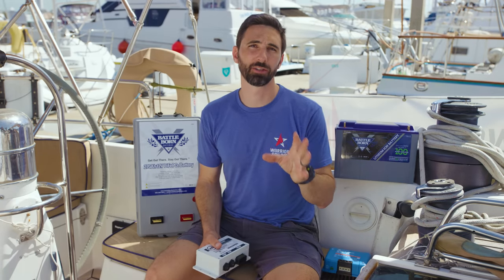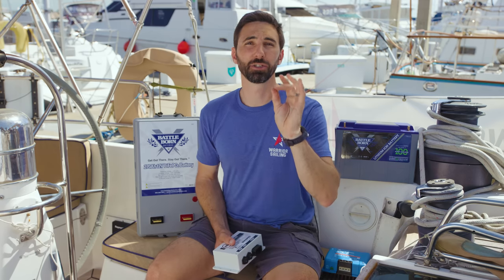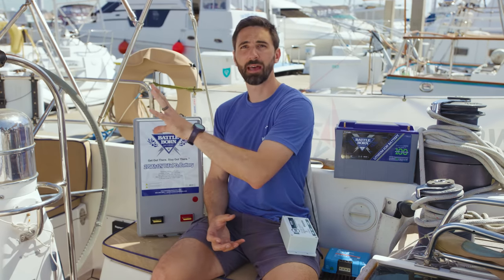Using your boat's engine is a great way to recharge your Battle Born house batteries, but it has to be done very carefully. The reason we talk about it so much is because using your alternator to recharge your house bank is a unique charge source that can be damaged if your battery encounters a BMS shutdown event, and it can also damage your boat's electrical system. The whole issue is that your alternator is spinning really quickly, putting huge amounts of power into your battery bank. If there's a fault condition that requires your BMS to protect the battery and remove the batteries from the electrical system, your alternator has nowhere to put that power — and it often catastrophically damages your alternator and can severely damage the electronics in your boat.